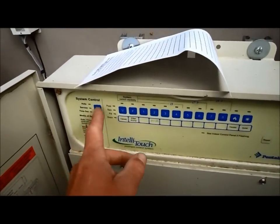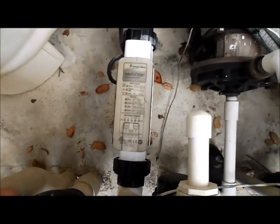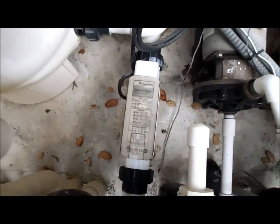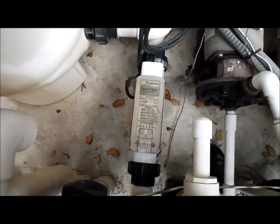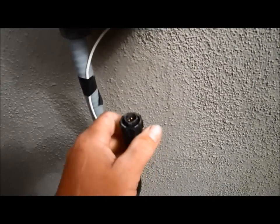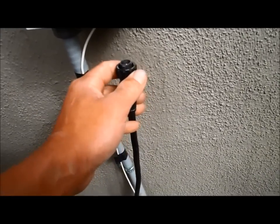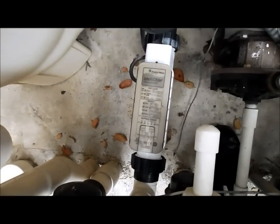The first thing you want to do is turn off the system. With this particular system when I turn it off, the actual power to the cell goes off also. You may have a pool that's not connected this way, so when you turn the power off to the pump and the panel it may not turn these lights off. What you need to do is come over to the power unit and unscrew the connector and take it off. You cannot clean this cell with the power on — otherwise it will never reset itself. So you must clean this cell with no power; simply disconnect it and make sure there's no power at all to the cell before you clean it.